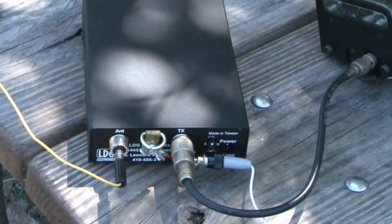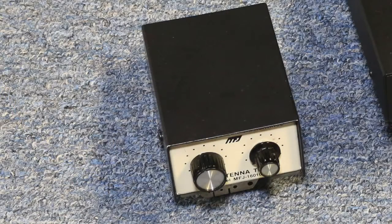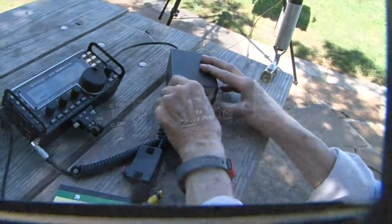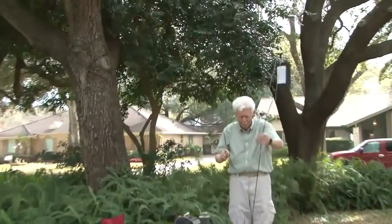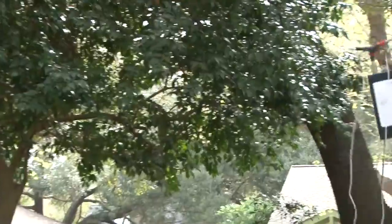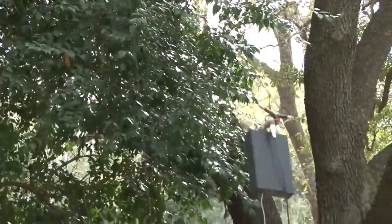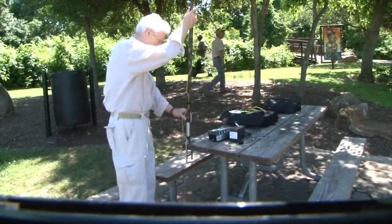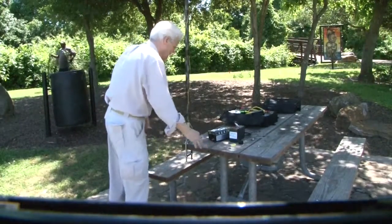Since the feed point of the antenna is on the table, you can use either the LDG or the MFJ tuner. With the MFJ, tune for maximum band noise then touch up and transmit while observing the SWR. With the LDG, just feed it some RF and it'll do the rest. If you have a tree or similar structure, the same setup can be used by substituting one pre-cut wire hauled up into the tree to replace the pole and table clamp. With the feed point so close to the ground, this is a compromised antenna and would be most effective with good propagation and CW.